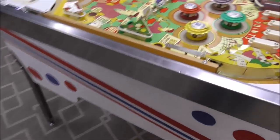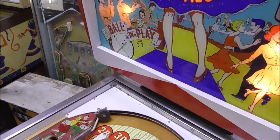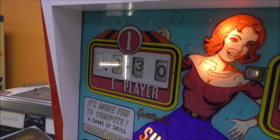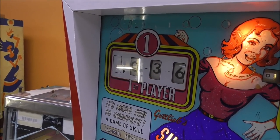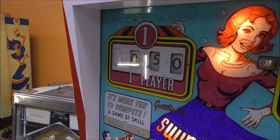Okay, folks, so I looked on the reel and the coil on the reel has a white and red wire going to it. And so I looked on the 1 point relay, and sure enough, the switch on the back has a white and red wire. And when I looked, that switch was gapped a little bit farther apart than the rest. So I cleaned it a little better, and then I made it where it's a little closer. And now, I did that with the power off, restarted it. Seems like we're getting there.